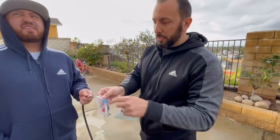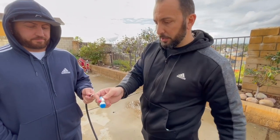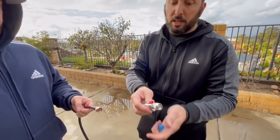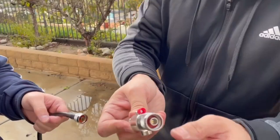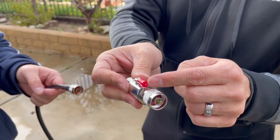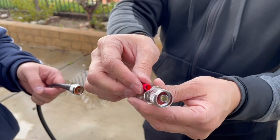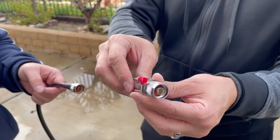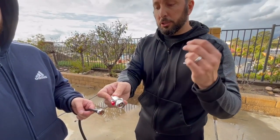I'm going to be linking everything in the description box below — it's going to be one link with all these products. This is the Lightning Arrester I got from Amazon, and this is the best one I found so far. If you guys find another one, let me know in the comment area. This one is N-type male on this side — you can see the pointy end — and then this is N-type female. And then this is where the grounding wire goes. I have AWG-12, but I was told that AWG-10 is a little bit bigger and it'll fit in there better. But I'm working with what I have, so we're going to work with the AWG-12 today.